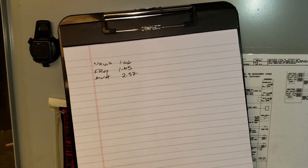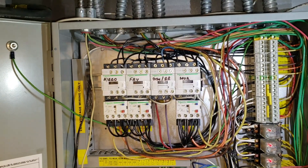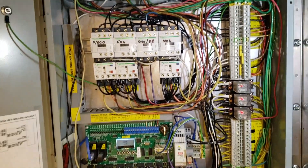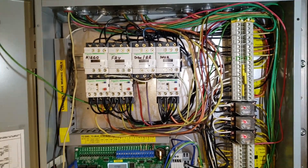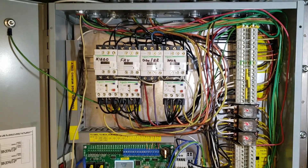We're looking to see these amperages increase but not go over the maximum motor amps. We're all finished up — I labeled everything and set the amperage on the motor starters, so everything's looking good. We did speed things up, and we're going to do a follow-up in a couple of days to make sure they're happy with the smoke pull and everything.